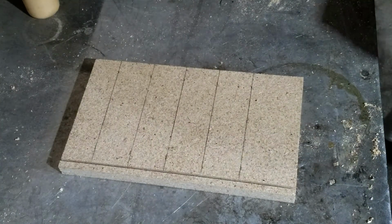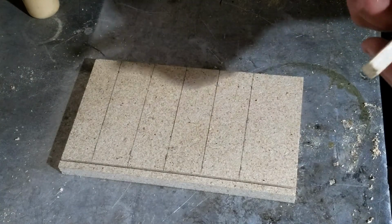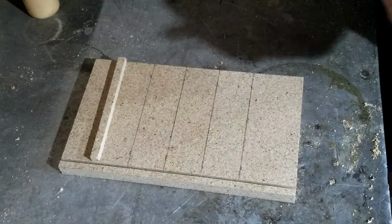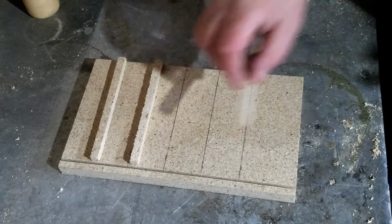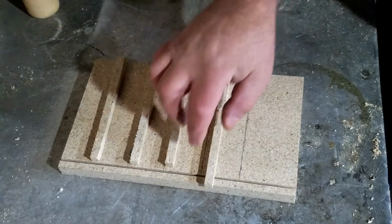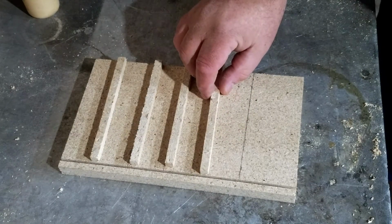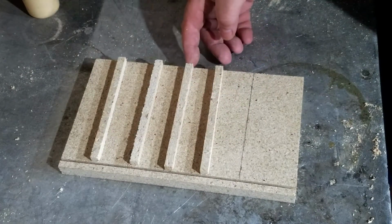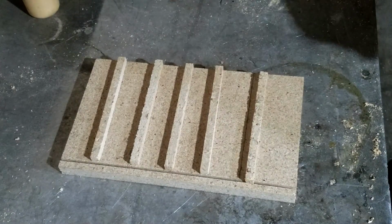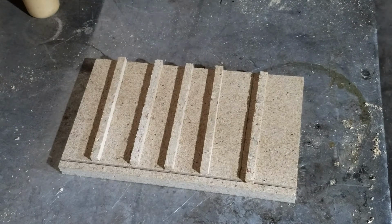And then you're going to take your little boards, these are your middle runners, and you're going to glue them just underneath that line on each one of them. Careful not to go over your rabbet here, stay on the back side of it, flush up against the back. Alright, so let's go ahead and do that to both of your sides.